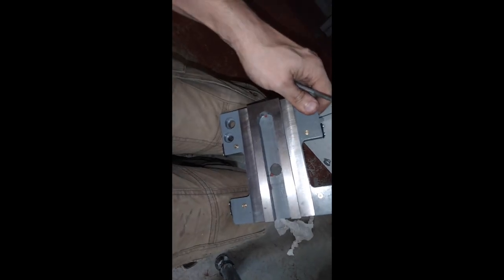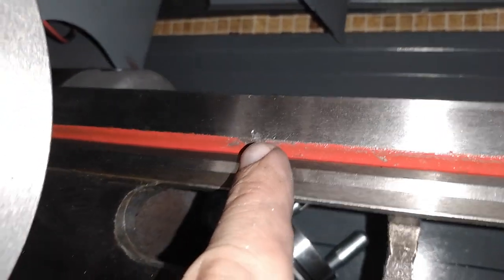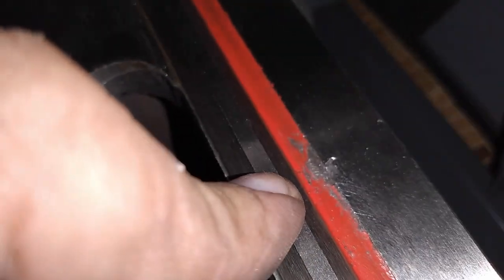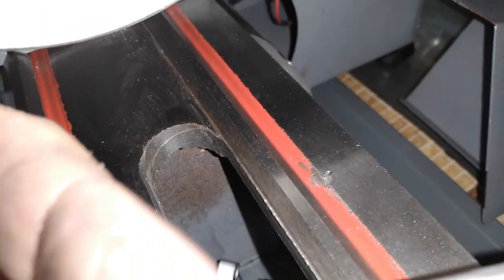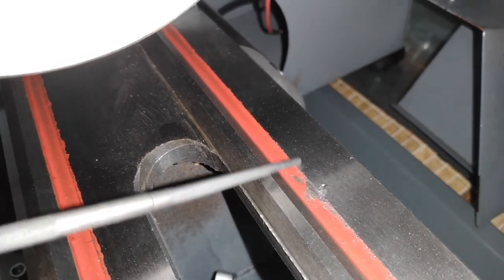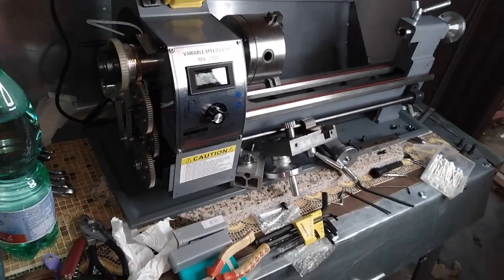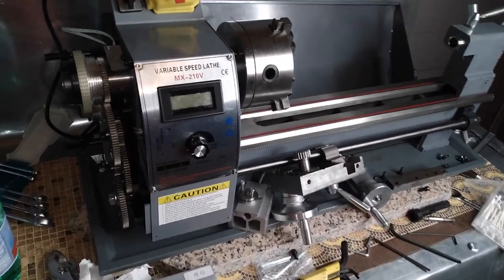While I had the ways clear I had a go at fixing the pitting — it's much improved, a lot smaller than it was. There are a couple of little scratches, but before I had little ridges sticking out and now it's all smooth — just a small dip, which hopefully won't affect the carriage too much. And here it is in all its glory. You'll notice how everything is carefully placed so I know exactly where it all goes back together. Right — that's why I need to do this quickly.